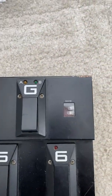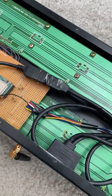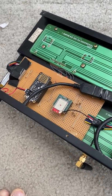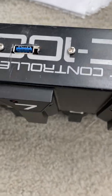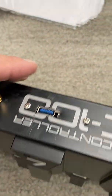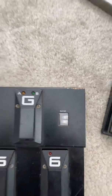In the back here, this socket connects via a mess of wires to the USB input on the 328p, and it comes out to a little socket on the side. I can power and charge the battery from there, because the 328p will charge the battery when it has power and is turned on. I also program the 328p through that same socket.